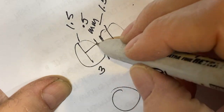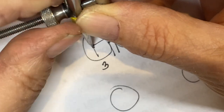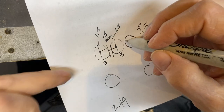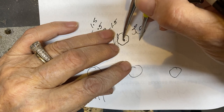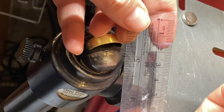I would set the dividers to 3.5 millimeters, leave one in the middle, then walk them over — that's my next center, and my next stone would go there. That would allow for the 0.5 millimeter between the edges and the three millimeter distance. You could go all along a band by doing that, and you could scratch a little scribe mark in with the dividers. I have already set these because it's too difficult to do in the air. What you really want to see is one leg of the dividers on the outside of the line and the other one on the inside — it's just a hair over three, we're talking hundredths of millimeters. The way to test it is to drag your dividers over your metal from one side, then drag from the other side. If you end up with a single line, that means it's exact center. If you end up with double lines, you need to adjust your dividers a little bit more.